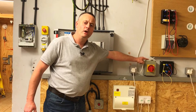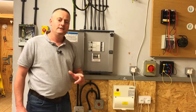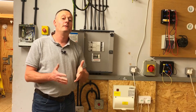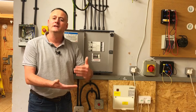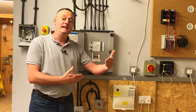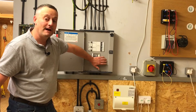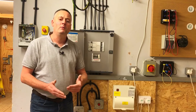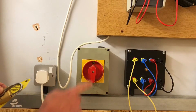Often on AM2 and AM2S rigs there is a remote switch to isolate the distribution board you're working on. This is the position where we will lock it off and put our sign before entering the distribution board to prove the circuit is dead. Remember, as we were turning off individual circuit breakers we should have been noticing lights, sockets, machines, etc. going off. When we enter the electrical enclosure we are considering it isolated, but working in a manner that keeps us safe even if it were still live.